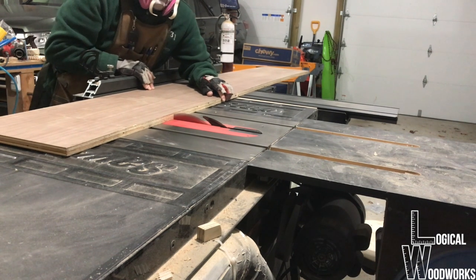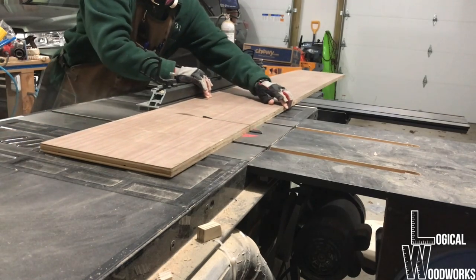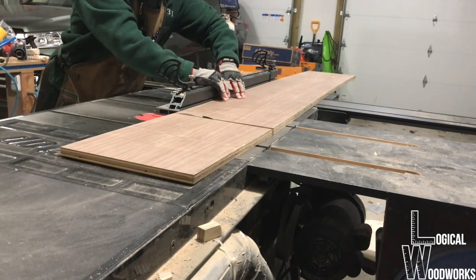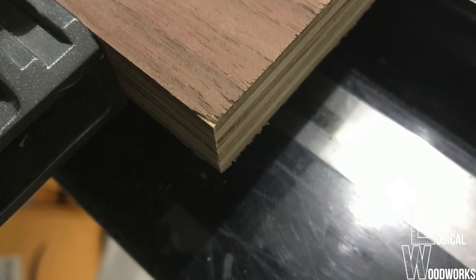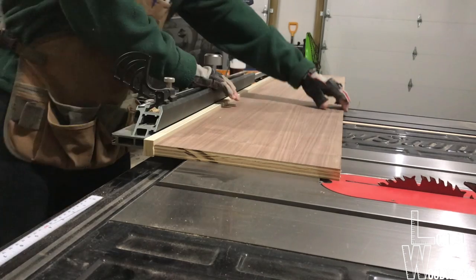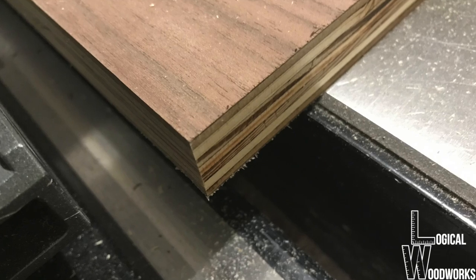When you're doing the real crosscut, make sure you have something like a plywood backer through the cut. Without it, you'll likely get a blowout looking like this. Something as simple as this strip will help make sure that you get a clean cut. Whew! So nice.